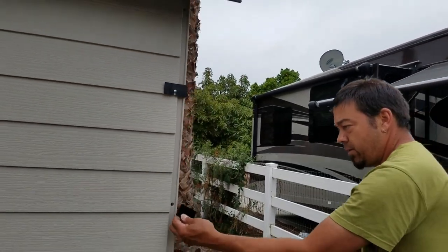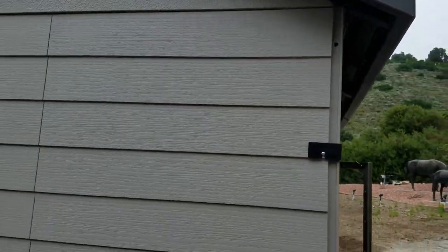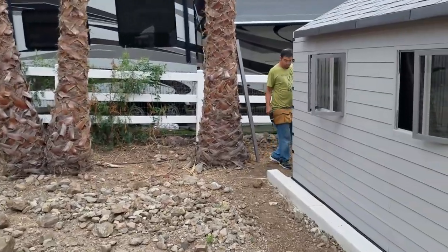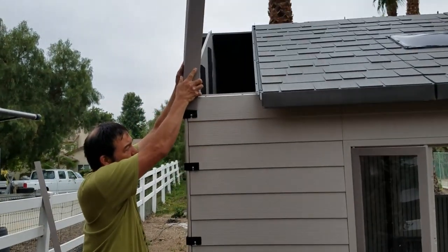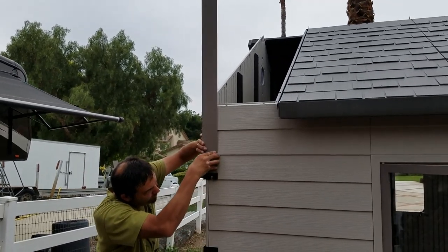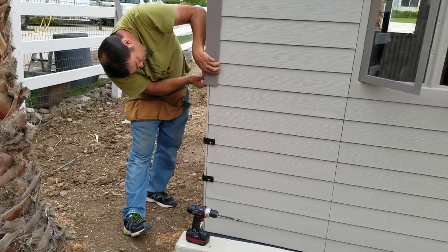And then onto the back two — these brackets are the plastic ones and they have this little groove with a hole. It pops right into where it has to go, and then you get a screw here and another screw on the other side. I'm showing you here — the other side looks like it's already been installed. All the brackets get a screw, all the way down the line. You'll see they have the little holes there, the marks where they drop into the corner. They can only go one way. Wiggle them into that little groove and screw them down so they're on nice and firm. You don't want them swinging around too loosely — just screw them on firmly, because you'll come back through and drop that corner cover right down through the grooves on the sides of the cover and over each bracket as you see there.